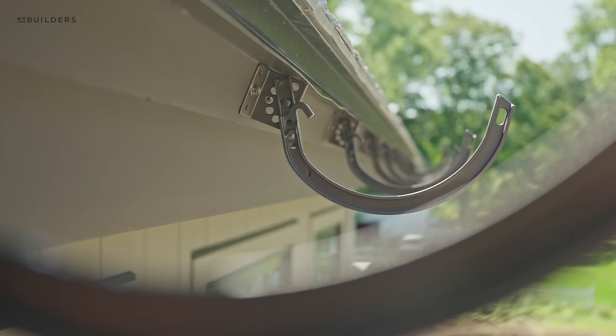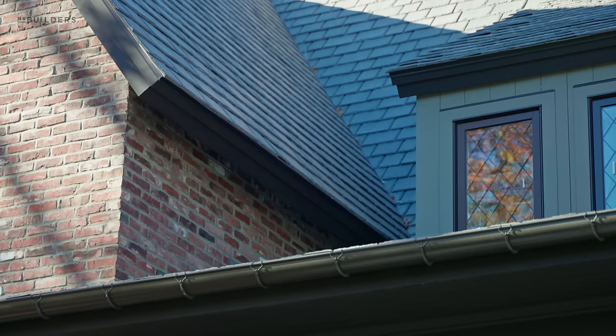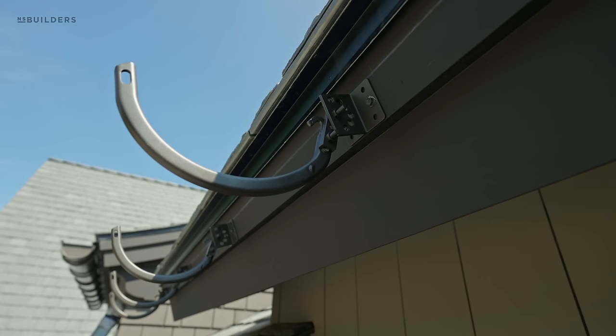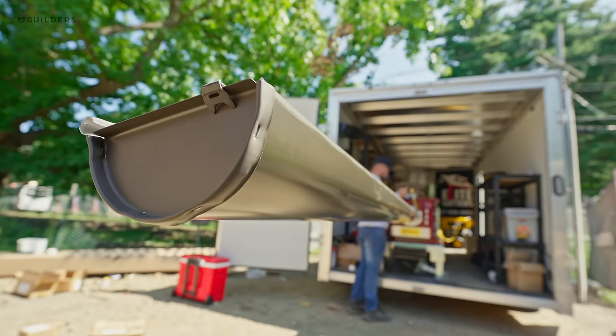They are a half round, so you have the gutter brackets that hold this half round gutter right up against the fascia board. If you look up at that roof line where the two gables come down to the center, you'll notice the rafter is a square cut rafter, not a plumb cut. If it were a plumb cut, your fascia board would be vertical — instead it's square cut, so the fascia board ends up on a pretty steep angle. We needed a specific gutter bracket to attach to a roof line like that, and you'll notice that around the whole property on all of these roof lines.